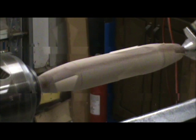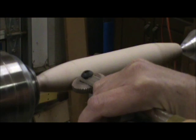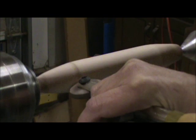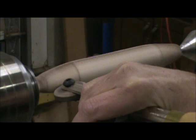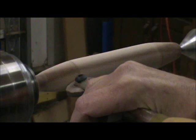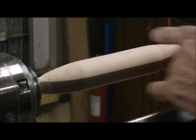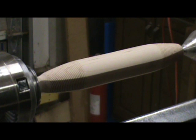I'll turn the angle and go this way — go in straight, raise the handle until it starts cutting. That made the spirals going the other way. Now I'm going to cut a little channel right here and here with a skew chisel to kind of set this part off.